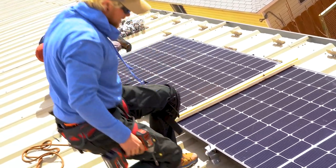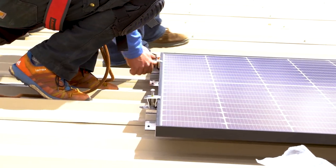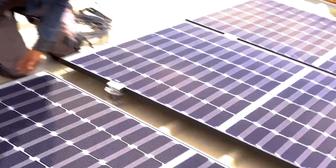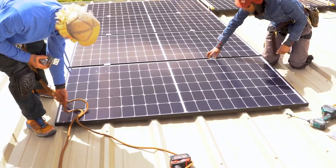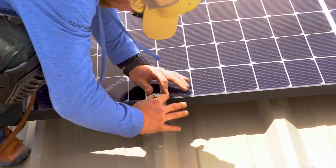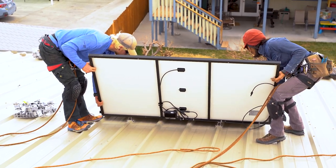Here we're tightening it all down. You can see those brackets at the top of the panel are just loosely laid in — no screws yet — because we're getting them dead straight and also at the correct elevation above the roof. Once the bottom row is tightened, we'll come through and put the screws into the bracket where needed. This ties into the design of the PV kit: it can be used as a jig itself running up columns. Also notable: the PV kit is UL listed for bonding from module to module going up a column, so there's no need for lugs or wires along that path.